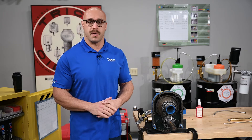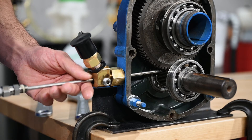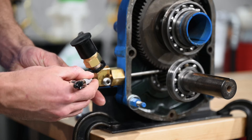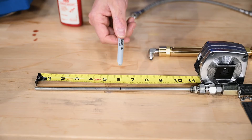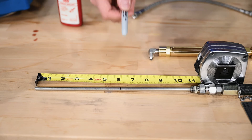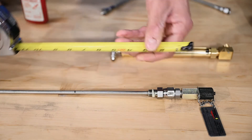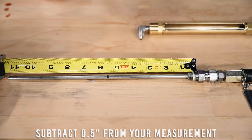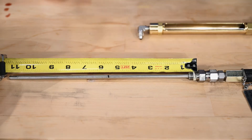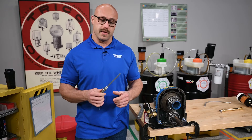First, we need to ensure that the pitot tube is sized properly. In order to properly size your pitot tube, you'll want to slide it through the already installed fittings until it makes contact with your internal components. Then, mark the pitot tube just outside the fittings. Then, measure the distance from the end of the pitot tube to the mark that you just made. This distance of 6 inches represents the distance from the outside of the fittings to the internal components. Now, we can use this measurement to determine the final length of our pitot tube by simply flipping it around and measuring 6 inches out from the face of the hex. Before marking your pitot tube, you'll want to subtract a half an inch from your 6 inches — this will ensure that the pitot tube does not make contact with internal components once it's installed. We went ahead and got this cut down to the correct mark.